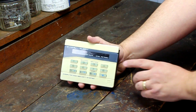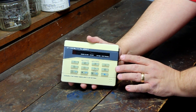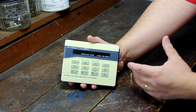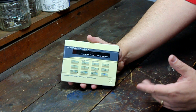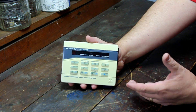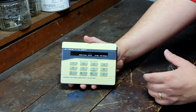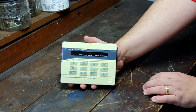But communication with the system works both ways. The system can communicate with the user utilizing the same keypad. If a certain sensor was triggered and that caused the system to go into alarm, then the control panel could send a message to the user via the keypad as to where the problem is. The message could be something as simple as a zone number, or with more high-end units, it could tell the user the exact room and sensor where the alarm was triggered.